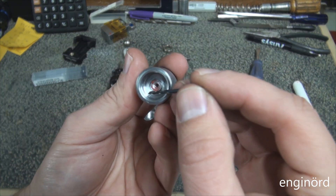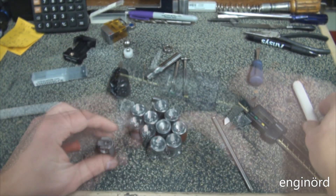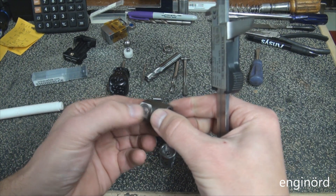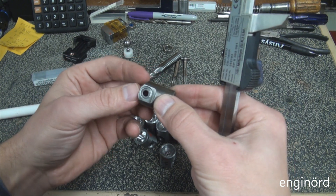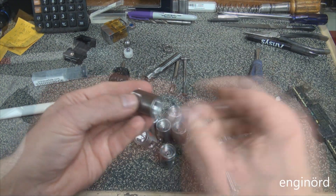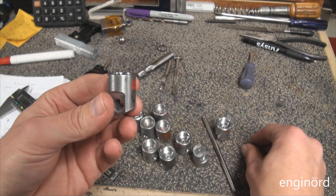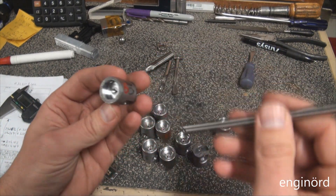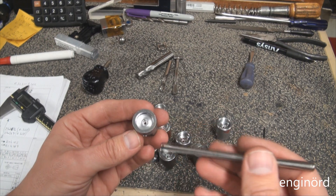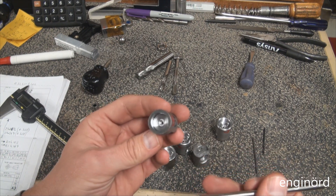This radius at the bottom came out really nice. The size should be 27.16 - you can see 27.11 here. But there's also play with this pin, and with a slightly larger pin it reads 27.26. There's one more important thing - to see if the position of the socket is in a proper position axially. Now radially, I don't know - it looks good to me. I don't really have a way to measure it unless I put a ball in it, clamp it, and then measure the ball from the edges.